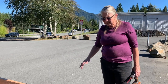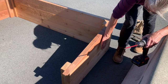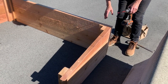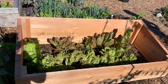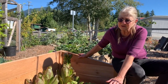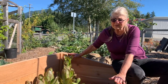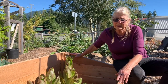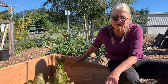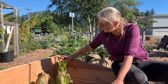Once you have this structure it's very multi-purpose. We've already screwed the sides together and the back together. We're just going to attach the sides to the back now. We put it together on a level surface, which makes it easier to get 90-degree angles. You can probably get away with building it right in your garden, but it might be easier to do the majority of it on a level surface first — if everything fits really well, it'll stay together for years and years.